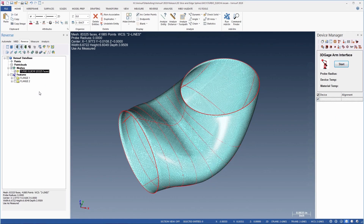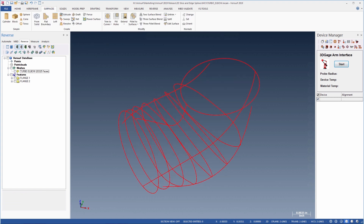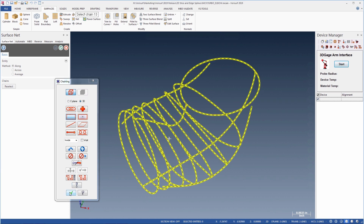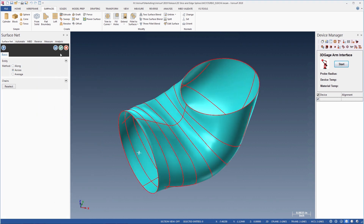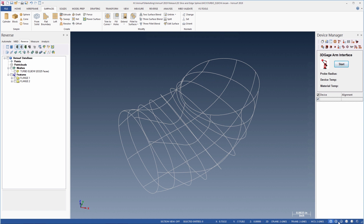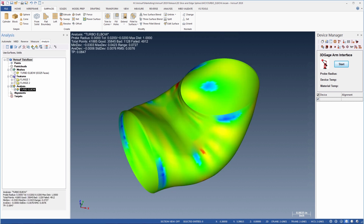For curves that don't lie in a section plane, we can use the sketch tool to create freeform curves by sketching directly on the mesh. These curves help define the surface 90 degrees from the axial slice. When the curve network is complete, we'll hide the mesh, then choose Surfaces, Net Surface, and select the curves. This gives us a single NURBS surface rather than a collection of patches. VeriSurf integrates inspection with reverse engineering, so we can easily check surface accuracy by comparing it to the original mesh to see how well the model conforms to the data.